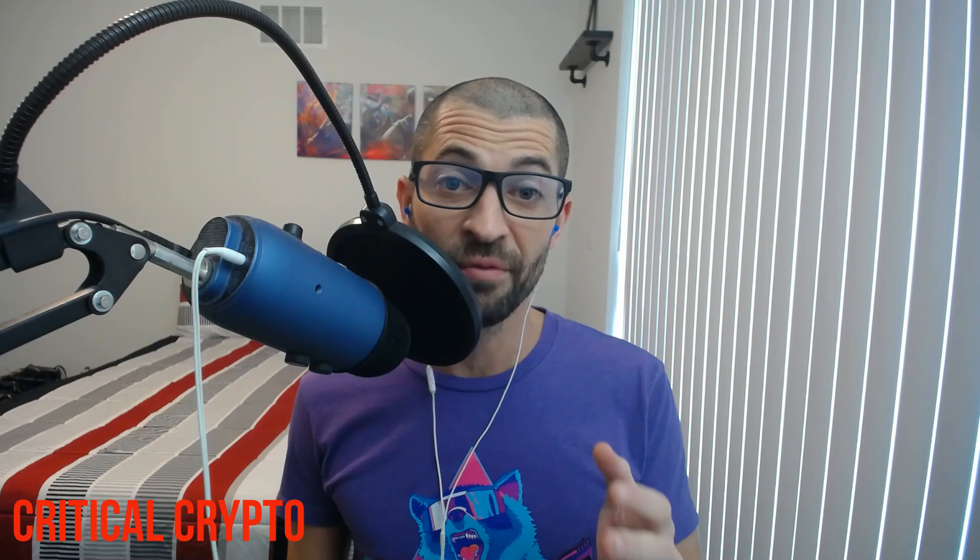The first thing I've learned, and probably the most important, is how to properly distribute the power through the mining rig. The reason why it's so important is because it's a safety issue — if you aren't doing it correctly, there are a lot of different ways this could be a fire hazard. There's an in-depth video on how to do this on Seb's Fintech channel, which I've linked in the description. That video talks about things like the 80% rule, where you don't want to push more than 80% of the power that something is rated for through it.